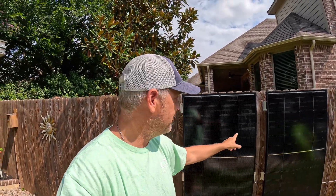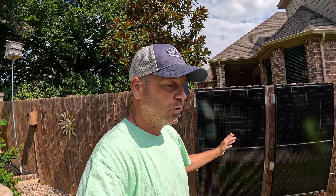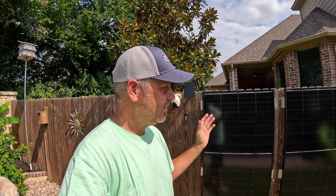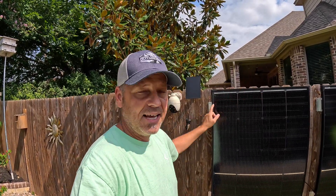With two of these tied up to the fence, I just used standard solar panel mounting brackets. They only weigh 21 and a half pounds apiece, so they're a little lighter and a lot smaller than regular 200-watt panels. I could load up this fence if I wanted to, but it's just an additional 400 watts. I've never actually gotten 400 watts given the way they're mounted, but I've seen it get between 250 to 350 watts.